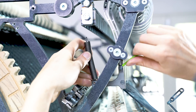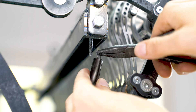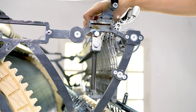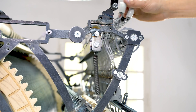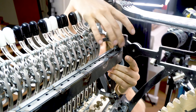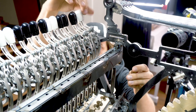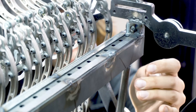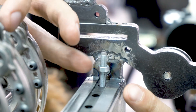I'm really happy to see that everything is lining up like I hoped it would in CAD. Here you can see that the spring is pretty loose, and with only one hand I can actually tighten the spring very, very fast. I just have to pull the spring out, get the nut loose, adjust it to any tension I want, and drop the nut back in its slot again. I can't think of a simpler, fewer-parts design for a spring tensioning system.